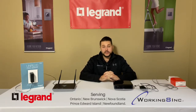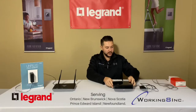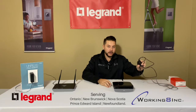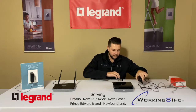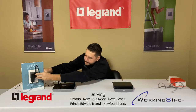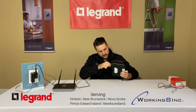So when you get your switches first installed into the wall, you're going to want to set up your hub. So the hub looks like this. The item number is the LC7001, and what you're going to want to do is hook it up into your home network. So here I have our router plugged in. The hub comes with the power cord, and it also comes with the Ethernet connector as well. So you're going to want to power it up by plugging it into power, like so, and then hooking the power cord into the back,